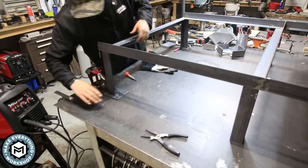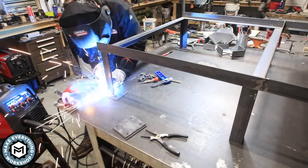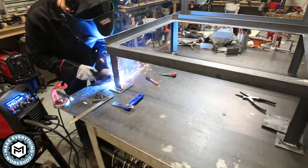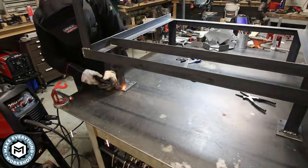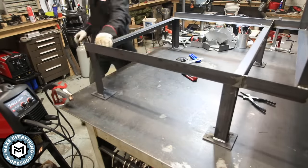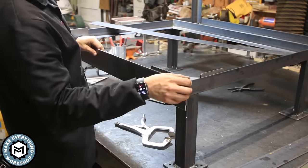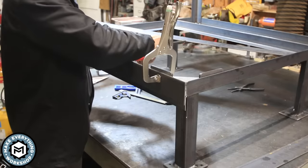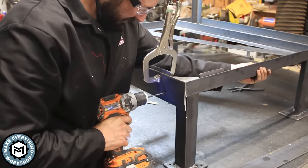This is a quick production way to get through stuff like this. Talking about this as a business, you really have to look at maximizing your time and getting as much done as you possibly can. By saving on that drilling I saved myself time — I'm making three of these carts, so that time savings times three does make a big difference and cuts into your bottom line. When I price a welding job I charge anywhere between fifty and a hundred dollars an hour depending on the complexity of the job and if I have to paint it or do any drilling. I figured it would be about six hours to make each one, and each one is about three hundred and fifty dollars in material. The casters are about fifty dollars each plus the steel.